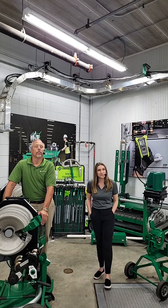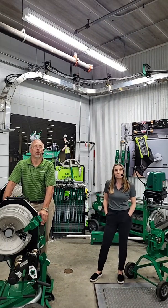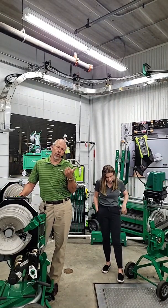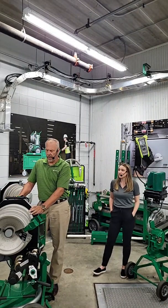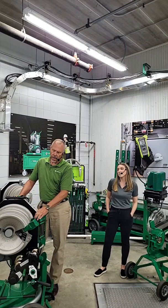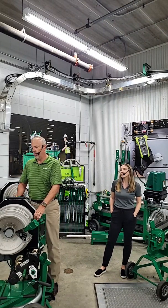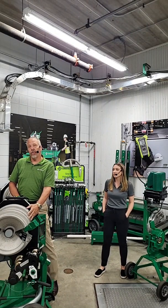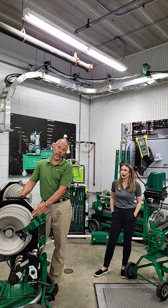If you get wrinkles bending EMT, how can you get rid of that? If you get wrinkles in your conduit, first, make sure you're getting good quality U.S.-made conduit. Wrinkles can be eliminated or removed with the squeeze adjustment found on the 855, the 854, or the 555 platforms.